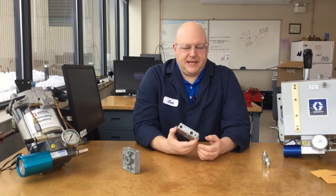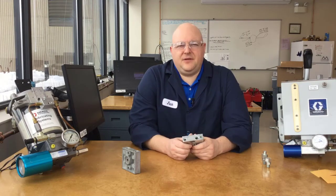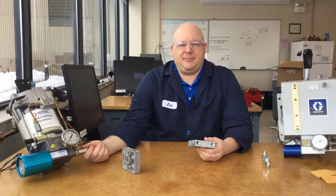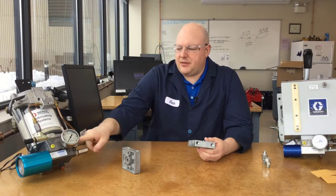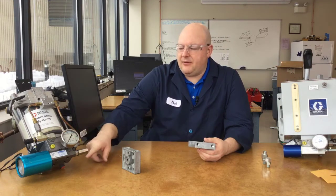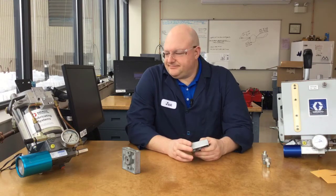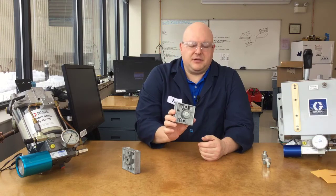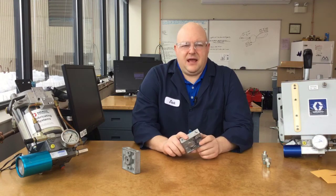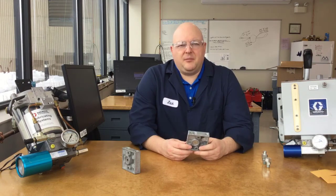You'd really only use one of these wall-mounted versions if you're replacing an old pump. Even if you have an old wall-mount setup, it would still be a good idea to transition that application to the modular setup with the pump directly mounted to the reservoir, to modernize the system. But if you need a wall-mounted base plate manifold, that's all it is — you lose the opportunity to have an outlet pressure gauge, but you gain the ability to remotely mount the pump away from the reservoir.